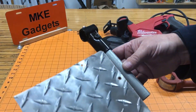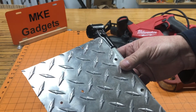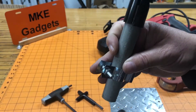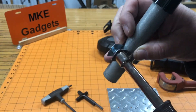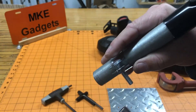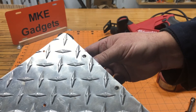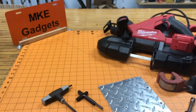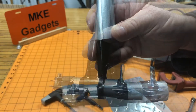If you build a project and want to add maybe a piece of diamond plate for a shelf or a piece of wood and you want to attach the conduit to your sheet goods, you can pick up these conduit clamps that slide over and tighten up. They tighten up with a 7/16ths nut. When you go to buy them, buy the ones with the carriage bolts — that way you don't need two wrenches, one on each end. If untightened, you can screw it onto a piece of wood or diamond plate and make a shelf or a bracket. Just be careful because you've got long threaded parts sticking out — you may want to buy a shorter bolt so it doesn't catch on something.